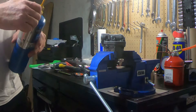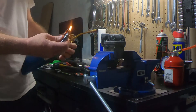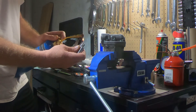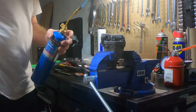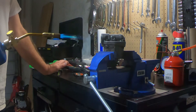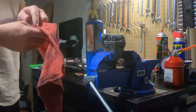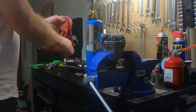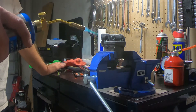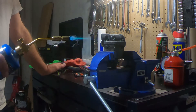Got my lighter — let's get this torch lit off here. I have a little bit of assembly lube in the bore; I was trying to keep some lube in there but I'm going to wipe that out real quick. I don't know what will happen to assembly lube when it hits 400 or 500 degrees, and I don't want to find out. I'm trying not to shoot fire directly into the hole — just kind of moving around the outer surface of it.